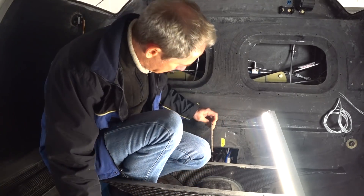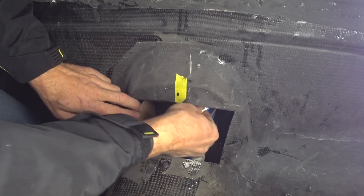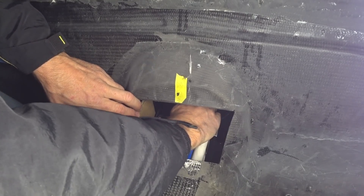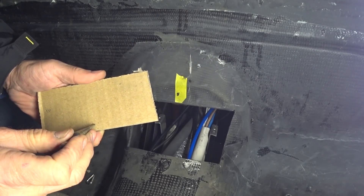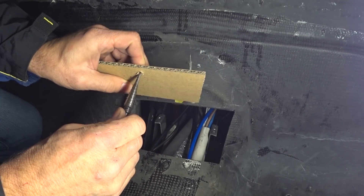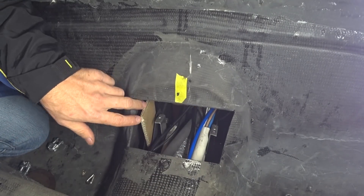What I'm doing here is making a little template out of cardboard for the fixture jig that will help me drill that hole in the right place. I've got that little cardboard piece in place and, with a pencil through the existing hole in one of the brackets, I'm marking where that is. Once I've done that I can punch that hole through the cardboard using my little step drill, take it out to quarter inch. I've already figured out in CAD where the position needs to be — it's basically two inches forward and one inch up.